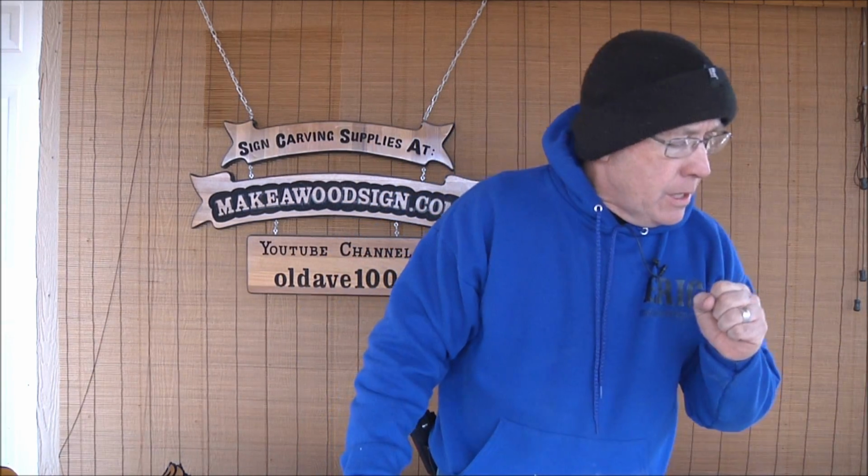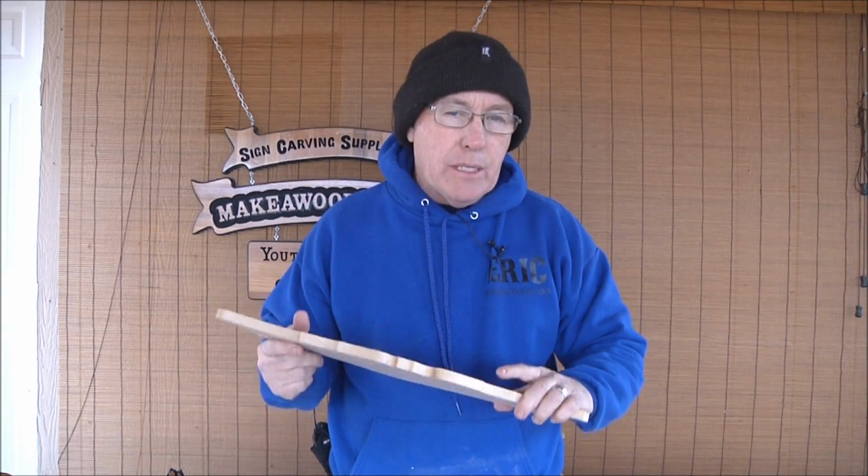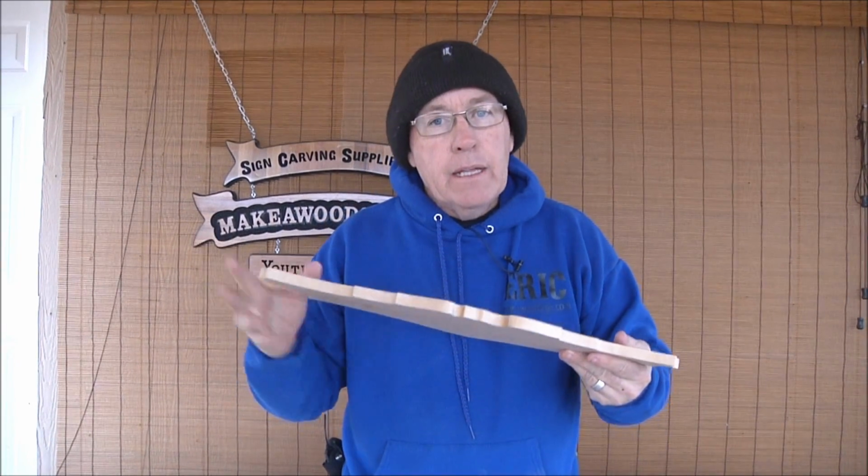Secondly, I got several questions, including from my wife, asking why did you cut that out of MDF just to use that as a pattern to cut out of the HDPE? That's a really good question. Freehanding the HDPE with that spiral upcut bit gets a little tricky. It's not easy to do, especially the way I went around and trimmed it all up.